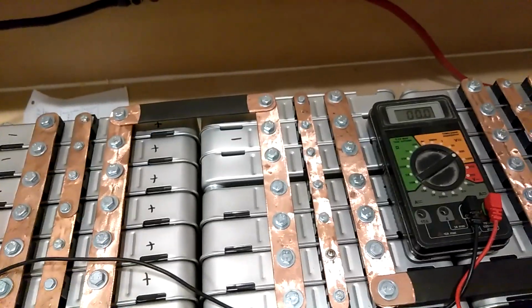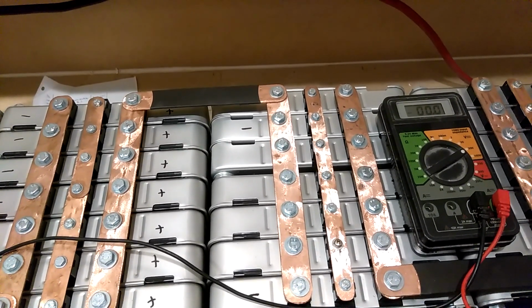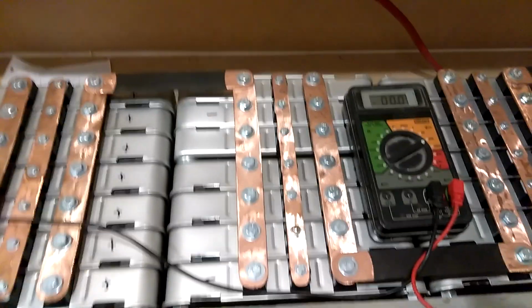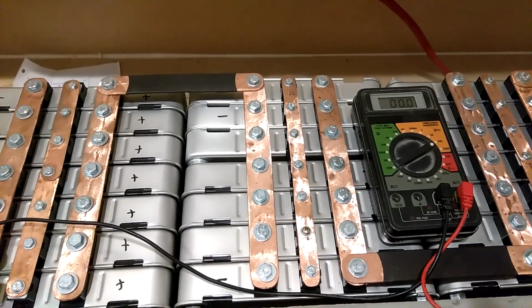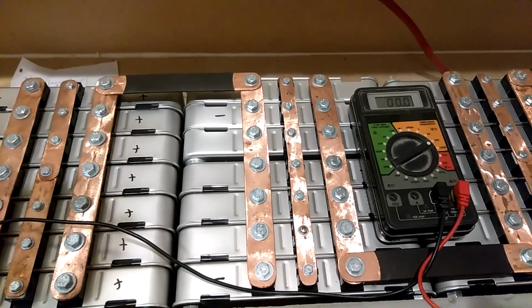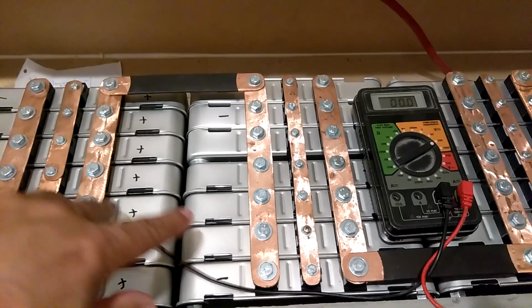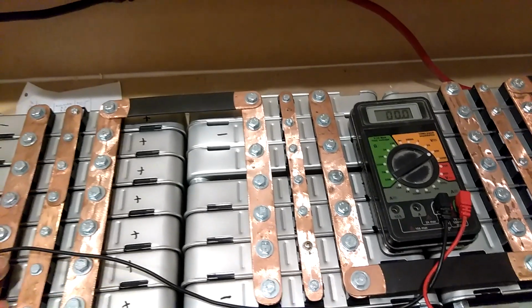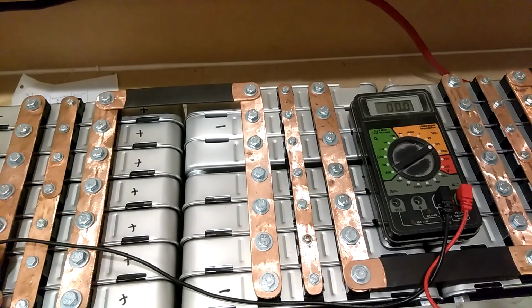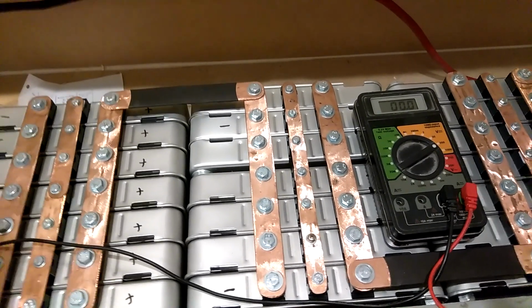So that's why I try to keep my batteries somewhere between 90 and 95%. Don't go over that because I don't know which one is correct, this fluke meter or that unit in there. I can take this unit and go in there and take it directly off of the lugs that hold the positive and the negative inside of the unit, and it reads the exact same as this battery. So going through the unit, maybe it's not calibrated right, or I don't know which one is right. So that's why I always try to stay below on that unit.